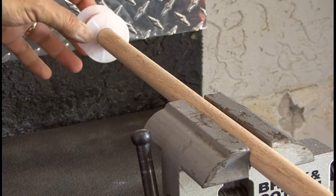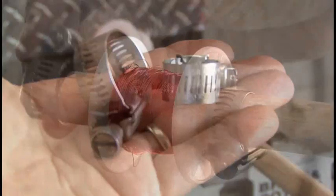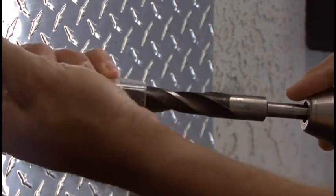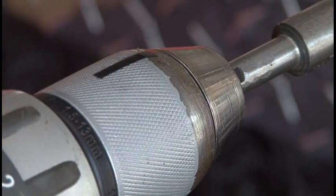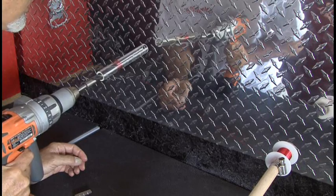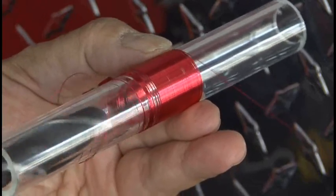I found a wood dowel that fit right inside of my enameled wire spool and put that in a vise, and using a couple of hose clamps held the enameled wire gently in place. I also found a drill bit that fit perfectly inside my acrylic tube, so I put the tube over that and also made a little mark using some black electrical tape on the chuck so I could actually count the number of windings. I held the drill in place and started running it slowly and counting the windings as I went. I thought this might turn into a complete mess, but it actually worked real well.